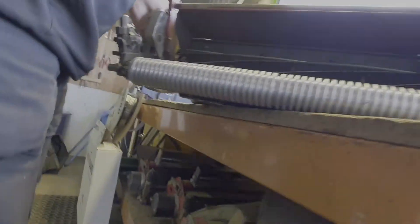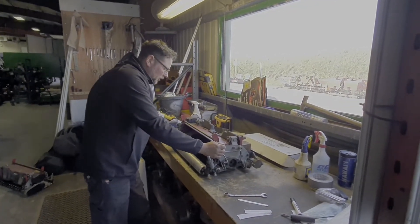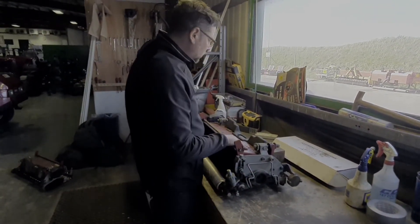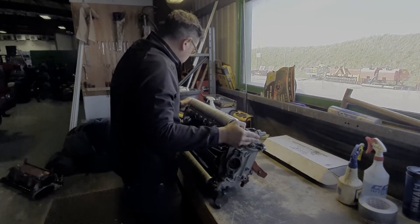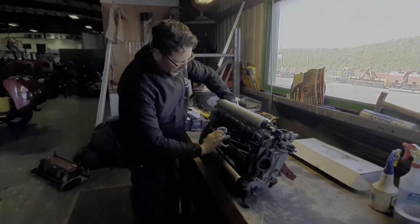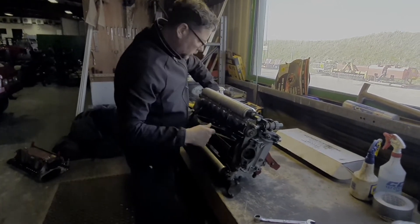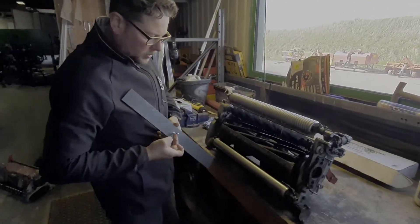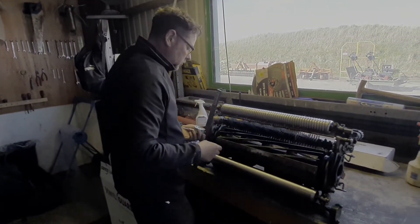Good. That's a card. Possibly the green paper will be worse. So that's a quality cut check. The next step is to check the height. Make sure there is no debris at the bottom blade, because it grabs from the bottom blade and if there's any debris it may affect your readings.